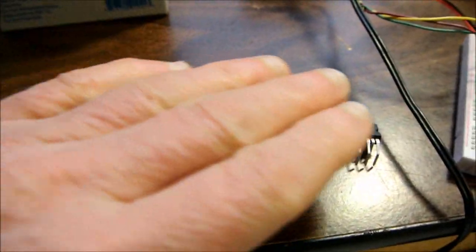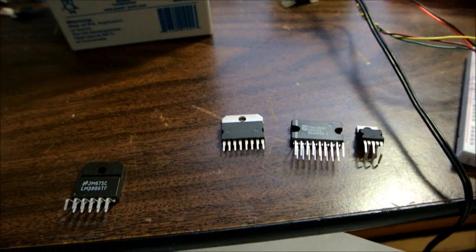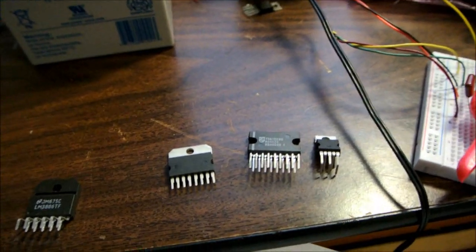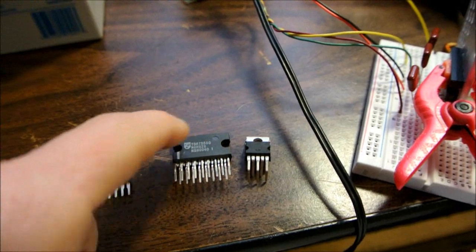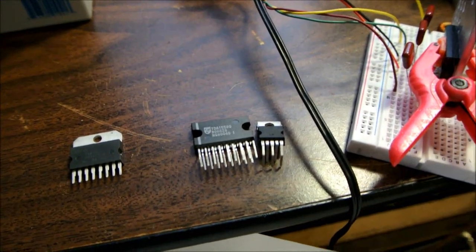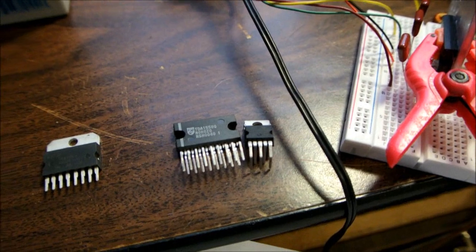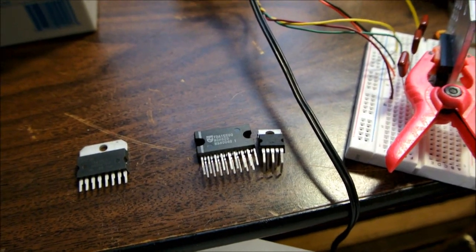These chips are starting to get into what I call the hi-fi realm. What is hi-fi? There's really no definition I'm aware of which says something is hi-fi — no clear borderline between performance being hi-fi and when it's not. The TDA2003 and the bridge chip have distortion performance that can make under 1%, but above 0.1% distortion, non-clipping. That's pretty good, but it's not really hi-fi.